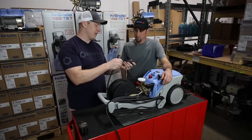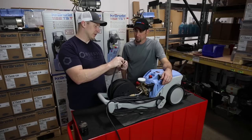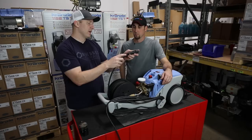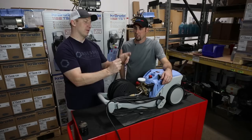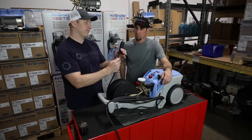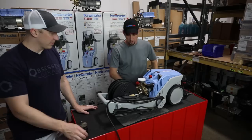One of the common freak-out points is this little piece that looks like an O-ring at the bottom. If you see leaking coming from the bottom, it's almost always the green O-ring — this other piece is just a stop that holds things so the collar doesn't fall back on the hose. It's a superficial part. So let's remove the hose reel to get to the head of the pump.